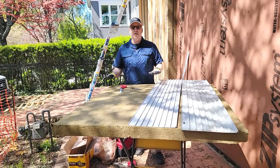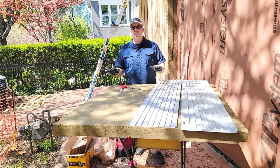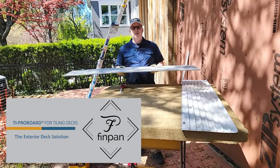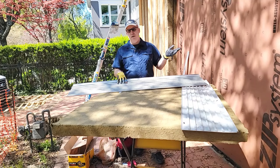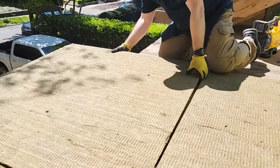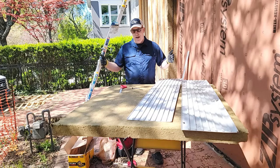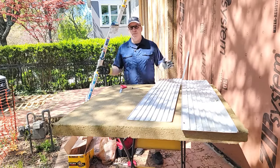Let's look at the assembly up top. I've got the framing and the decking — we're using Advantech up there, and that's going to be our primary framing for that. Now this product right here is called FinPan, and it's designed usually to go on an exterior deck directly to the joist. However, here I want that control layer — I want the Advantech and also need the insulation above it. So what we're going to do is put down all this insulation, finish the sides of the deck so we have continuous insulation, up the sides and it basically wraps around to the roof.